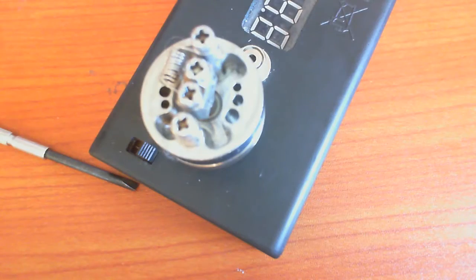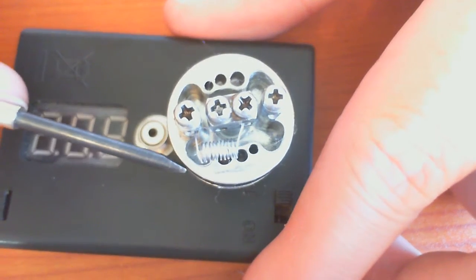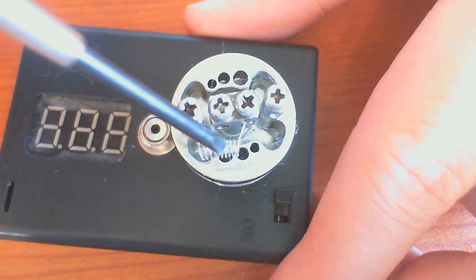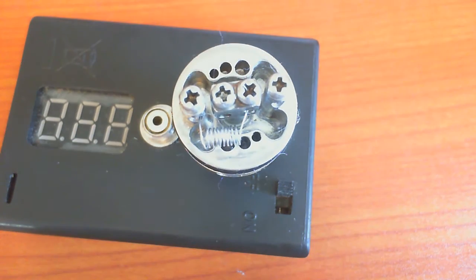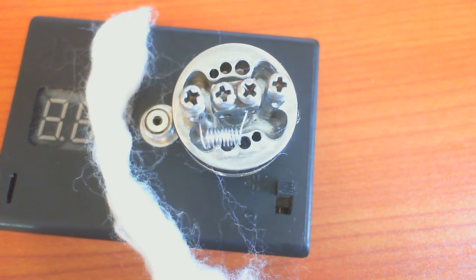Let's put it in. There we have our coil, roughly perfectly lined up over the large jet, because we've got the large external air hole here. You're not getting the entire air flow over the coil mainly because the diameter of the wire is so small - this is 24 gauge, not 26. Anyway, I'm going to wick this up as normal using rayon, like I did on the Kanthal build, and then stick it on my DNA 40.